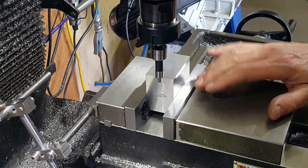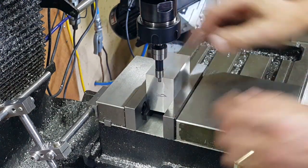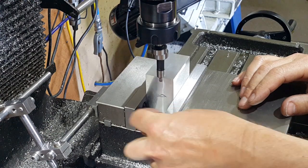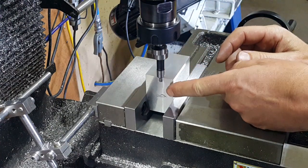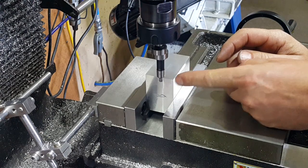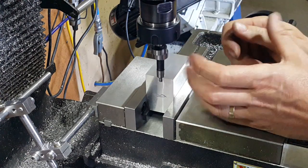That's our piece of stock down to size and I'm finished with that. What we'll do now is find the center across this width by using the wiggler, then come off the sides of the jaws of the vise and divide that by two, which will give us the middle. Then we need to come from the bottom — all the datums are taken from the bottom — so we'll come through three quarters of an inch and then we can start to drill our hole for the cylinder and bore it out to size.